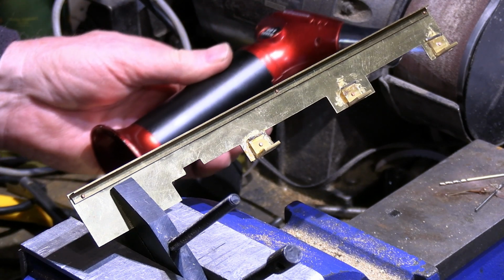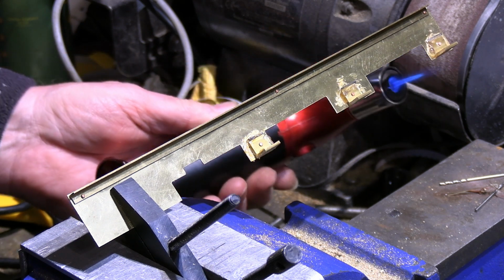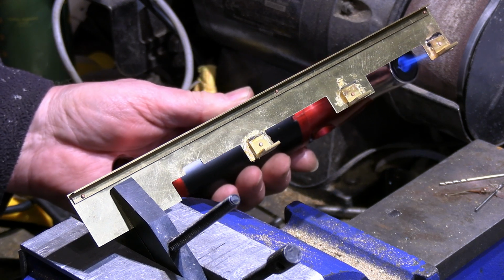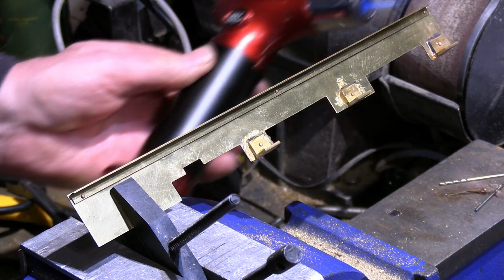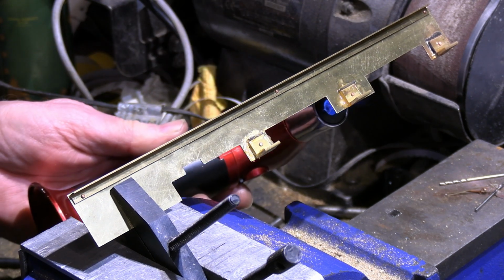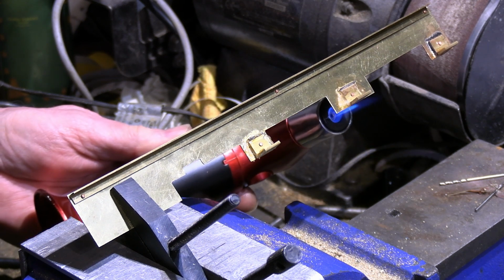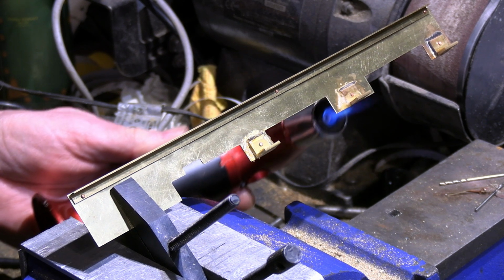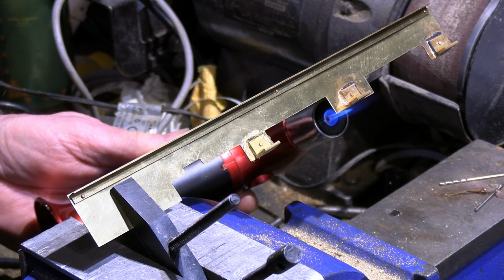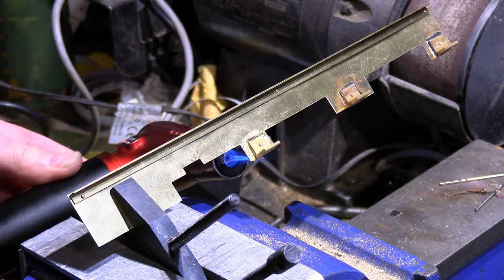Just place some heat gently on the back, and I can see that solder going already. That's lovely, that's just flowed all the way down. Here's the next one. And the solder, or any solder, will always travel where the heat is. With this being soft solder, it doesn't take a lot to get this flowing. There, that's just melted, and that's just flowed down the side. Same again.